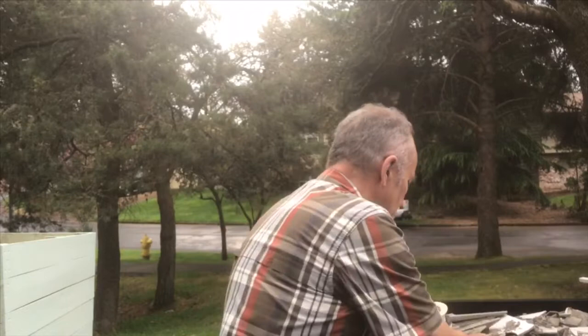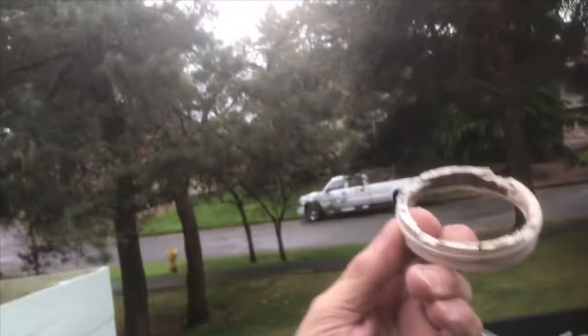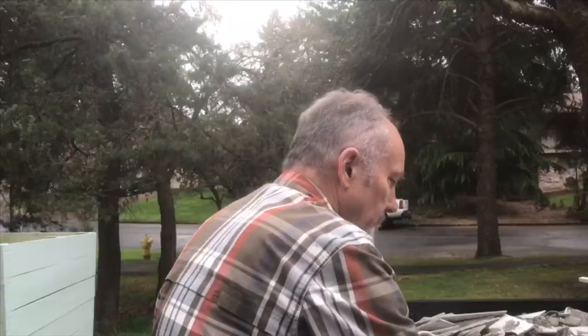So this I popped out, but then inside I used a claw and a hammer and popped it out. You could use a screwdriver or pry bar or whatever. And then this is down inside. This is a rubber seal that goes around the two inch ABS and then this compresses it and squishes it around there to seal it. There's four of them on the drain — there looked like a castle nut. It's got the little four spots and that's where those nails went in to grab it, to be able to turn it, to pull it out.